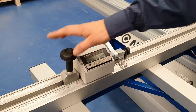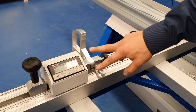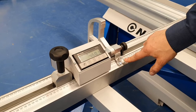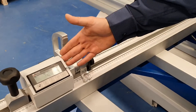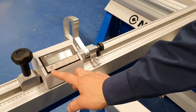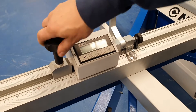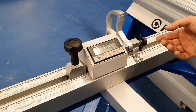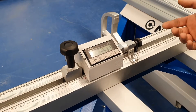The flip stop is incredibly easy to use and comes with several redundancies. If the battery or something happens with it, you still have the sight glass to read. As you can see, when you move it around the counter changes. If it goes out of calibration, it's very easy — just two buttons: the calibrate button and enter, and it will immediately change it. It's a very low voltage consumption unit, so the batteries will last a very long time on a single charge.